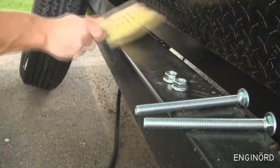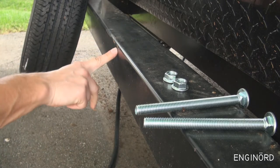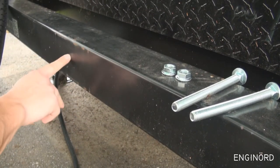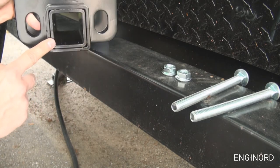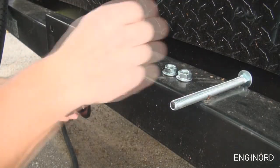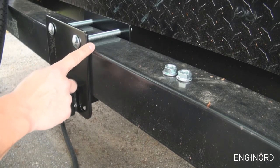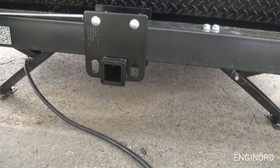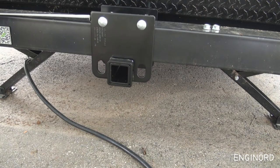I'll clean the surface just a little bit. There are some spots and marks that show some rusting — I think there was a component here previously that someone removed. This is the business end, so it goes on like that and bolts in. I'm going to measure the distance edge to edge and make sure it sits in the center: 39 on one side, 37.5 on the other, so it needs to shift 0.75 inches — that puts it at 38 and a quarter.